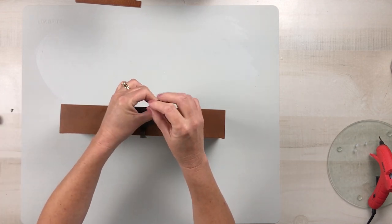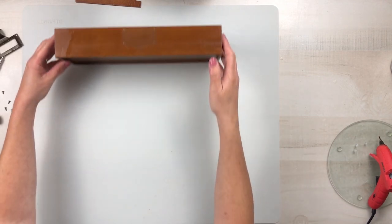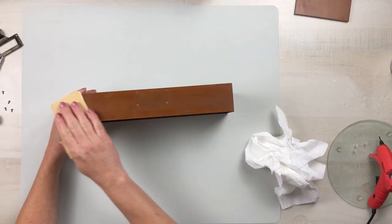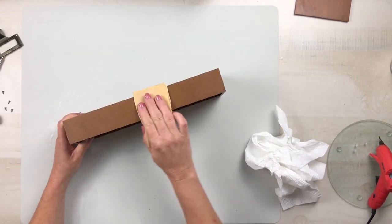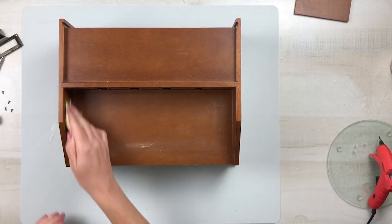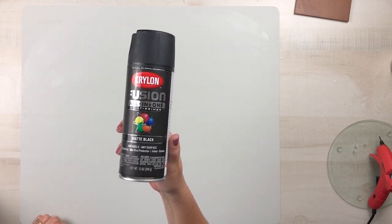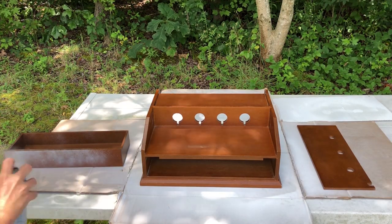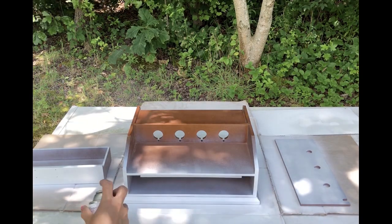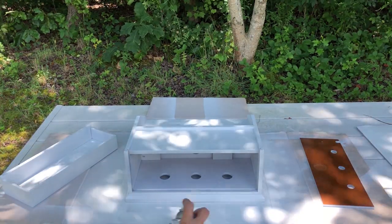I wanted to paint this cute little handle, so I'm going to remove that so I will be able to paint it in a different color, as well as completely paint this drawer insert. After everything has dried, I'm going to go over it with a very fine grit sandpaper. This is going to really help my paint adhere better, and if there are any kind of grime or rough spots, I can sand those down before I paint. Always after I sand, I like to wipe it off to make sure I get all of the grit or grime off. I'm using the same spray paint as the previous two projects as well as some matte black for the hardware, also made by Krylon. I actually took three coats because that is a darker color wood, and again I just let mine dry for about 10 to 15 minutes before I add the next coat, then I allow it to dry completely overnight.